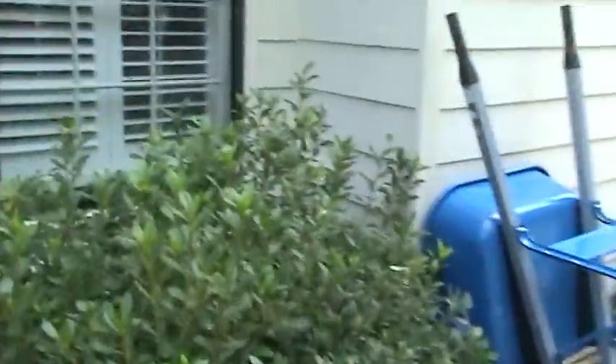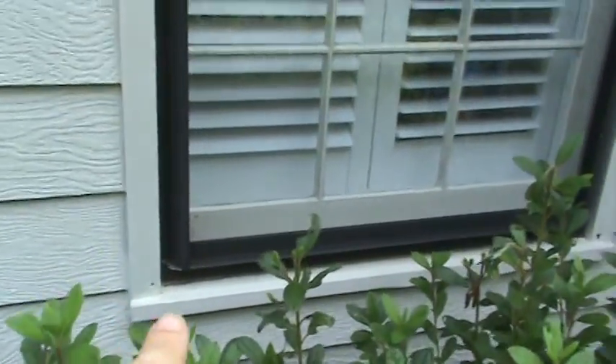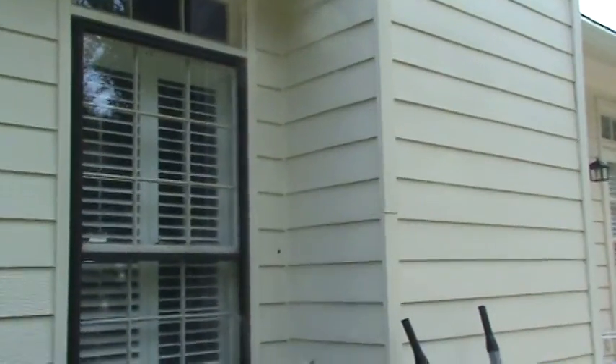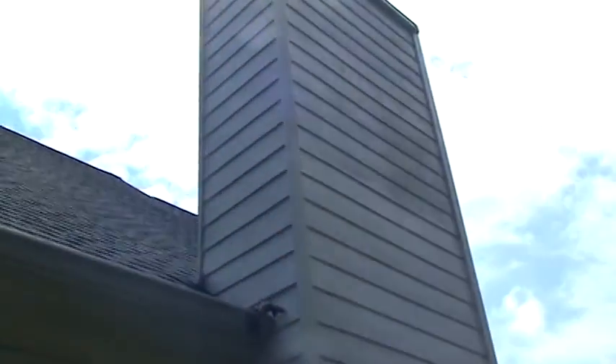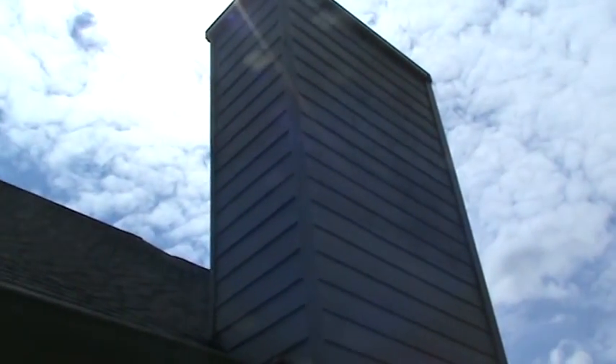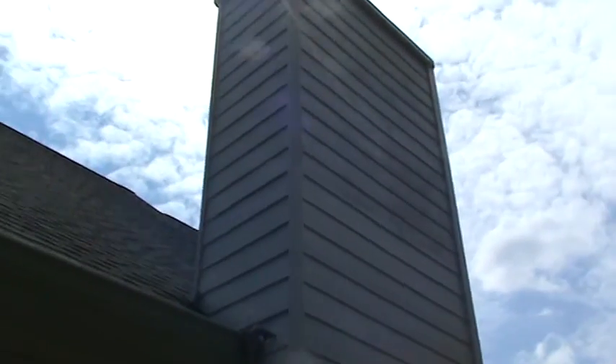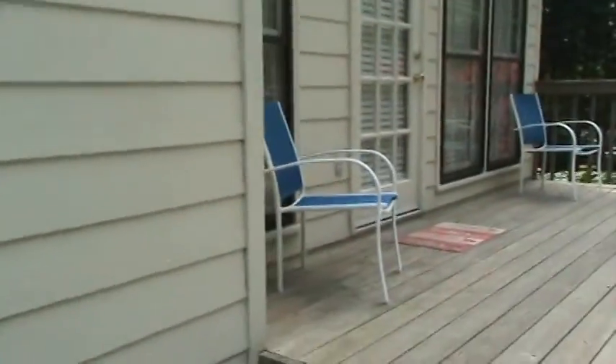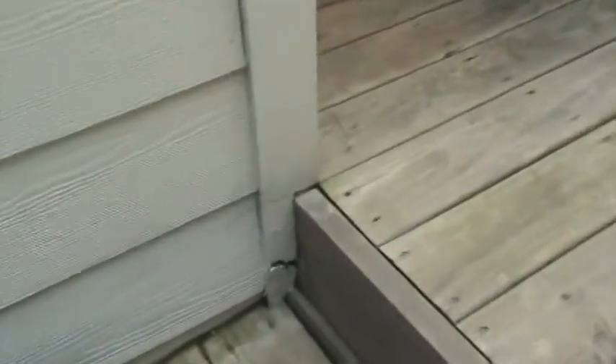This center here looked perfect until I touched it the other day — you can see my hand going right through it. We'll repair the center and the nose on that window. The chimney is another one. Almost every window — see this window to the left of the fireplace — both brick molds are rotted, but before you touch them they look great. You've got to probe this stuff. The chimney has an angle-cut repair on the corner board at one point, a piece of rot in the center, and all the way up top they've made a horizontal cut that rotted the wood above and below.